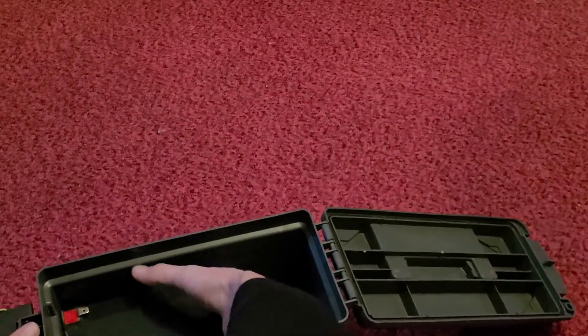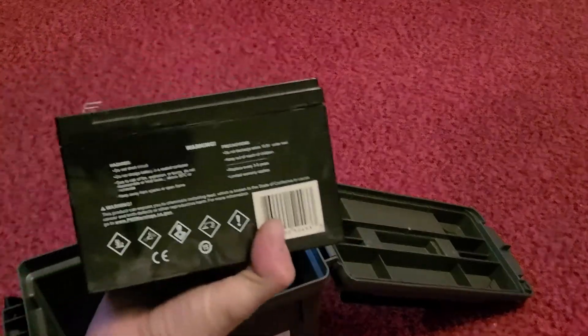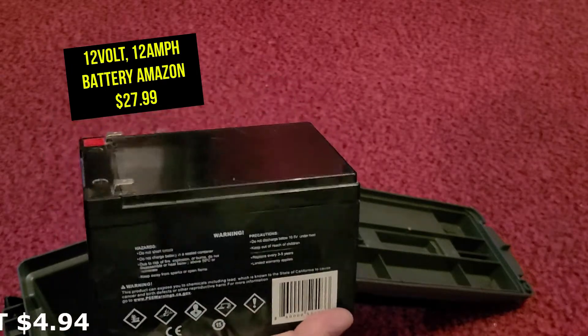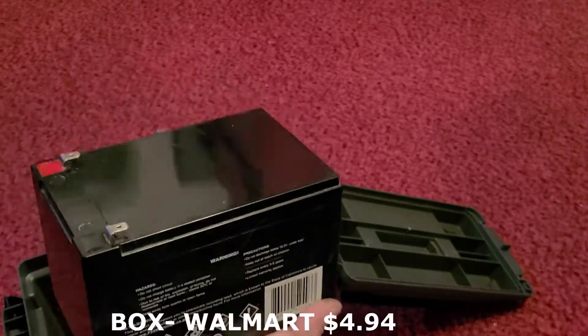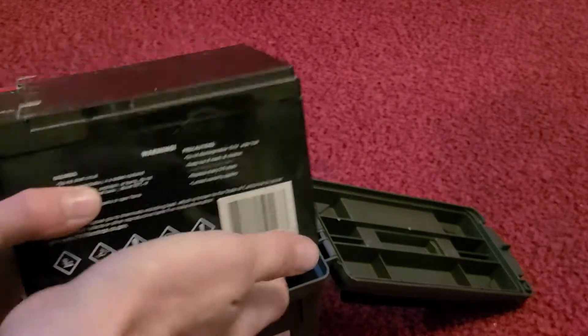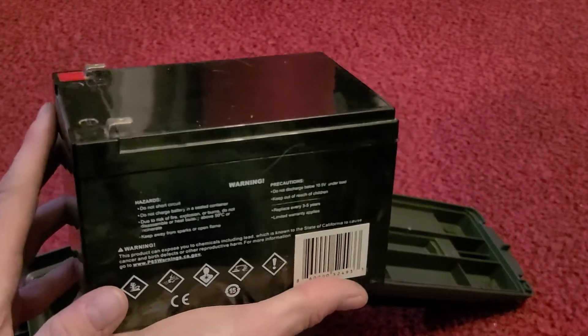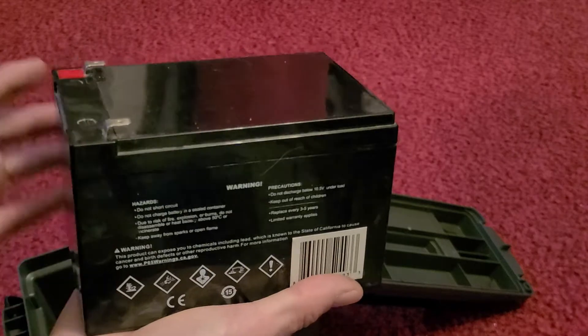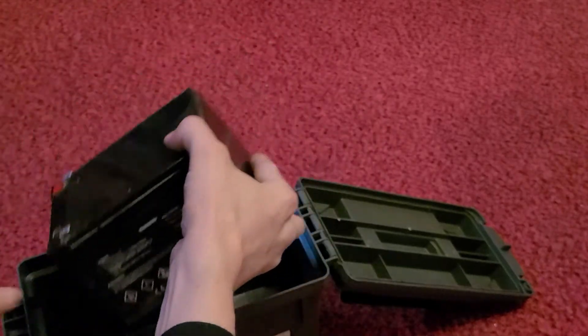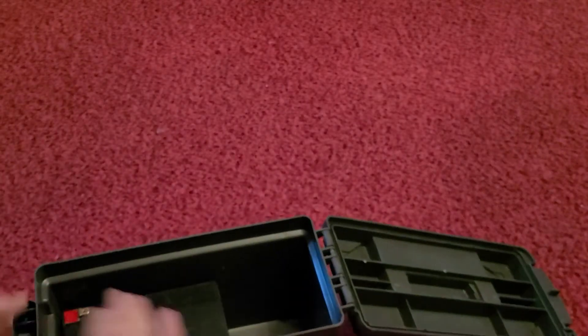The first box is the battery box. In here I have a flooded lead-acid battery — one of the cheaper ones you can get, but they work really well. This is a 12-amp-hour; I think it should be fine for what I'm doing. If it's too small on the couple of cloudy days we get here in New Mexico, I still want the lights to run. I'm going to slide that in up towards the front of the box and use the back for the ports, which I'll label so they don't get confused.